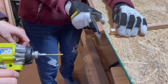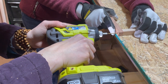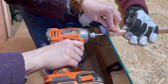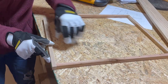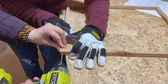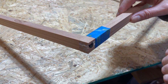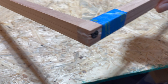We're going to use screws for the frame — this part is not visible, but you could use screws as a visual element if you wanted. We're also using cedar for the weight, keeping everything as light as possible. We're making two frames of one dimension and then connecting them, which gives us an economy of wood. We're dedicated to showing our mistakes as well — we knew there was a likelihood of splitting since these are very small pieces of wood, even with pilot holes.